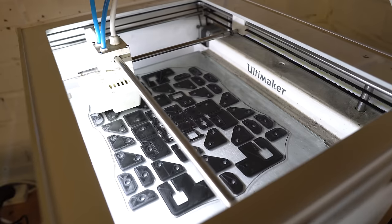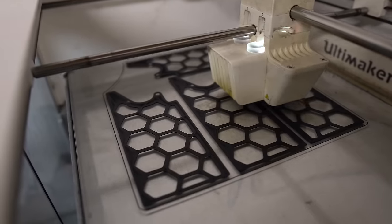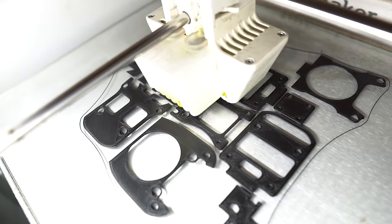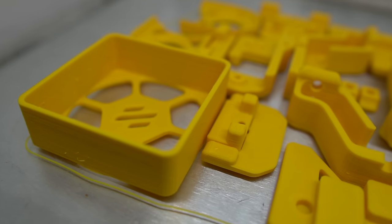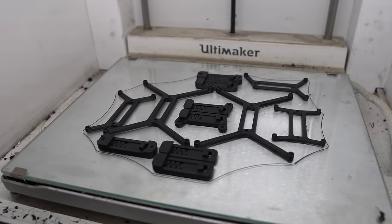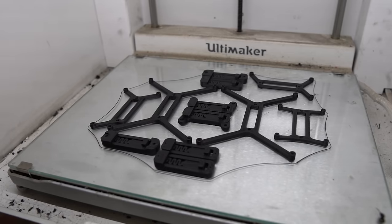I made the mistake of printing everything that I needed before I even received the kit, and I think that was a mistake. I would suggest that you only print all of the stuff for the mechanical bits, then you wire it up, get it working, and then print the skirt parts and all of the accessory parts that you need. You could have an issue where you're running out of filament. I've got a bit of yellow left and a bit of black left, but I'm running out, and the R2 spec changes all of the clips that hold the electronics to the DIN rail. So I had to make a decision, and I've printed those out of red ABS because I had a bit of red left and I didn't want to use the yellow or the black.